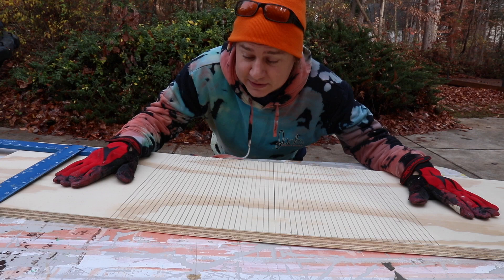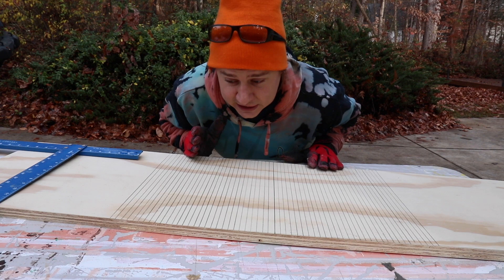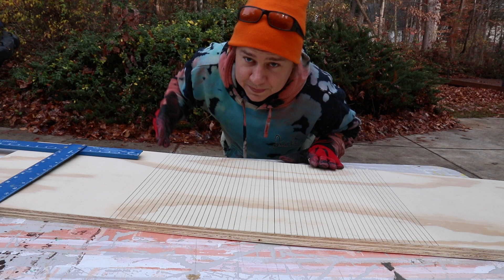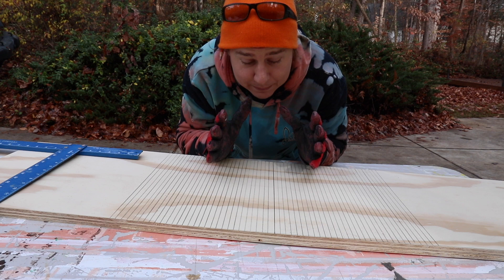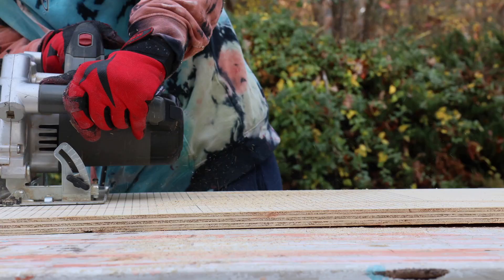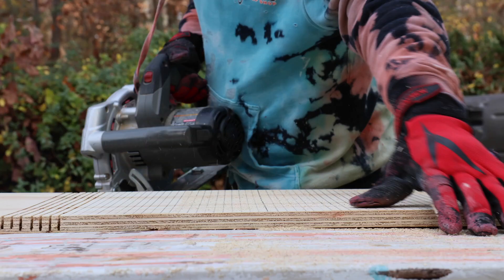What I've done is cut out this piece of wood and marked segments that I'm going to cut part way through — pretty much all the way but leaving maybe two sheets of wood before it gets through, so it won't cut all the way through. All these lines will get scored and this should enable the wood to wrap so we can have a smooth curve on the toilet. I'm going to give it a shot and see what happens.